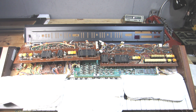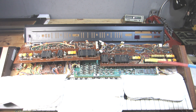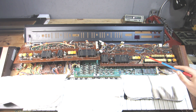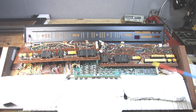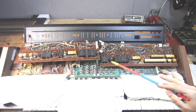That means clipping on test points, checking things on test equipment, doing what needs to be done to bring this electrically back to factory spec — and that's if there aren't problems that inhibit adjustments. The customer had this powered up and was playing around with it. I think he mentioned having some issues pulling up presets in the banks, and I don't know what's going on there. I'm going to swap out the battery on the back of the board, but as far as any memory issues, until I start peeling back the layers I'm not really going to know — and I won't start that until all these controls are working properly.